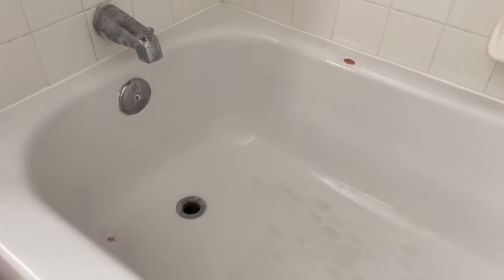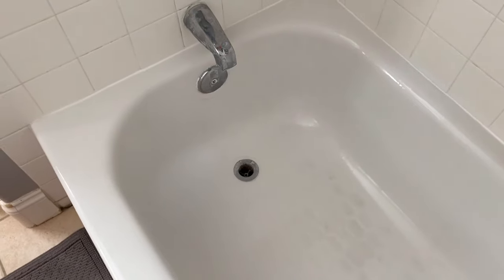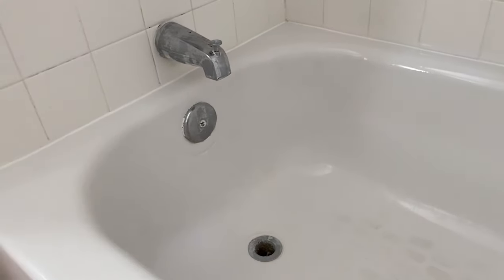I sand it down pretty hard removing any thicker areas, then spray using the Rust-Oleum appliance spray. This color matches best with any pressed steel tub or kitchen sink — there's no other reglazing material I've found that color matches as close as this. You can get it at Home Depot or Lowe's. There you have it — real quick and easy bathtub chip repair. If you have any questions, make sure to leave them in the comments below.